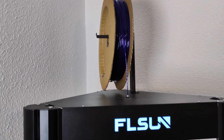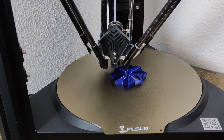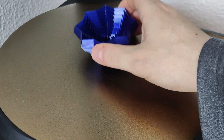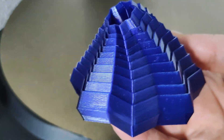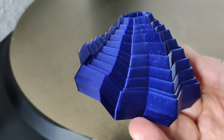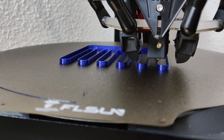As in other printers I own, 255 degrees Celsius is still a good temperature for printing with PET filament. For a first time, I was very pleased with the result — the print was clean and fast. 50mm per second is a conservative speed, but it is double the speed I use in my other printers.